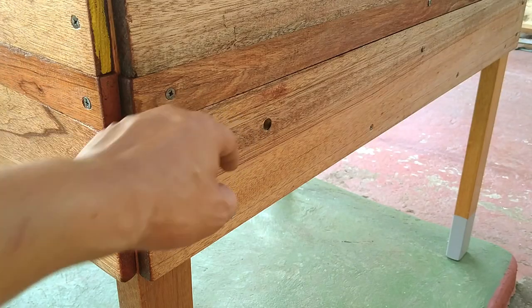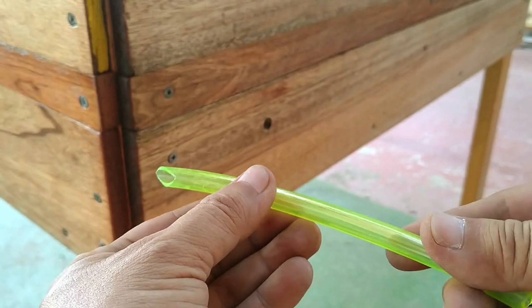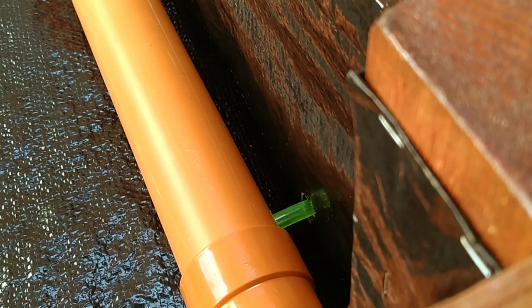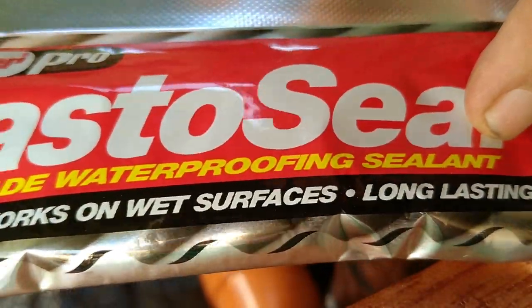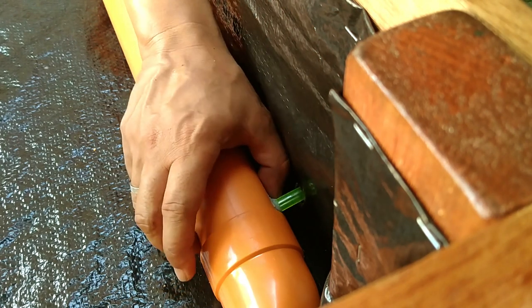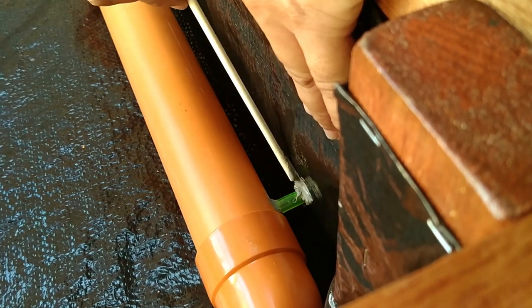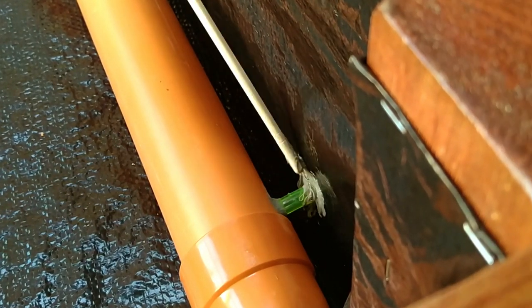We take a half-inch plastic tube about six inches long — this will serve as our drain hose. Make sure that you cut one end so it looks like this. Then we insert the tube through the hole all the way inside the PVC pipe. Using a waterproofing sealant, we permanently set the tube in place. Finesse the sealant with your finger to make sure there are no gaps and air bubbles. We also seal the gaps between the plastic tube and the pond liner. If the space is too cramped for your fingers, you can use a popsicle stick or chopsticks. The goal here is to make everything watertight all around, especially the area underneath the tube.